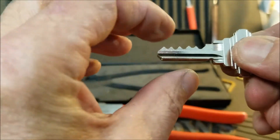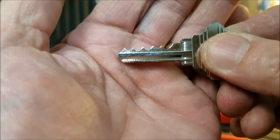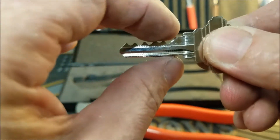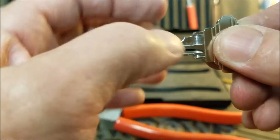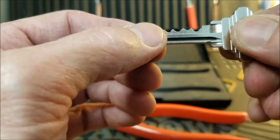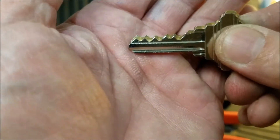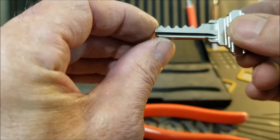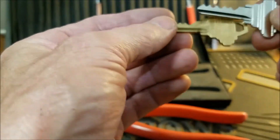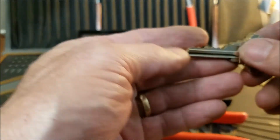When you are doing this, you've got to make sure it's really tight in the vise. Each cut you want to make sure you realign everything up after each cut, because when you cut it can sometimes violently shift, and then you have to make sure you realign that before you make your second cut. I might not have had everything exactly lined up making a couple of the cuts, but it did work and I did cut the key and it actually worked.